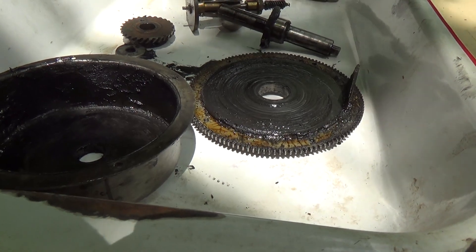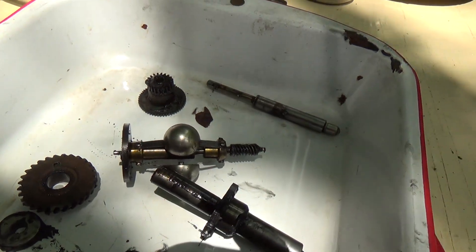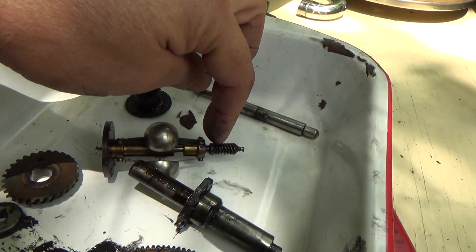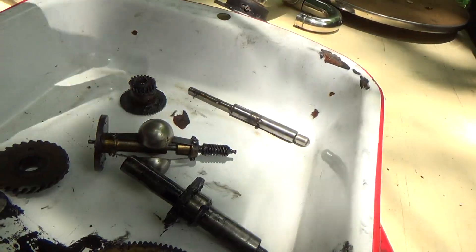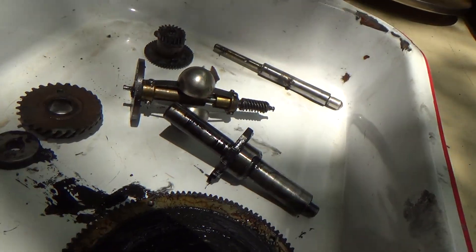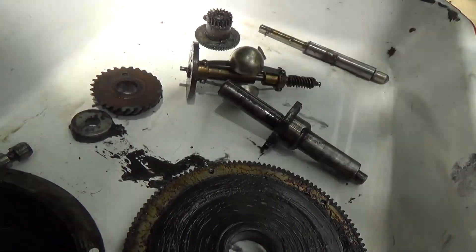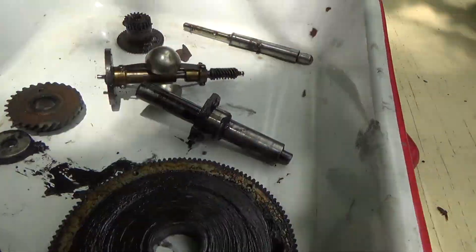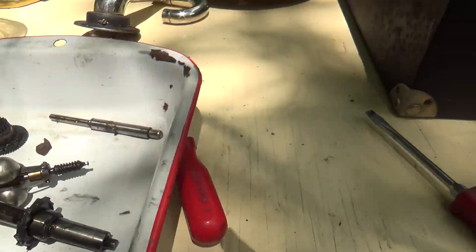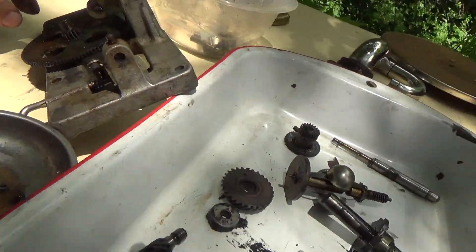You're not putting too much grease on anything with brass anyway. Things like your governor — right there — that's mostly going to be oil, not grease. You don't grease the friction leathers or the governor shaft. You just put a little bit of grease here, just a little bit on that gear, that thread right there. Don't get carried away — a little goes a long way. This is not an internal combustion engine spinning at 3,000 or 4,000 RPM. Most of your grease is going to be in the spring barrel and on these larger steel gears.